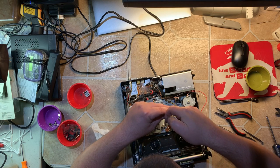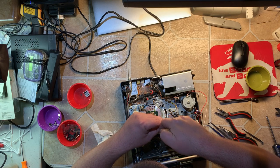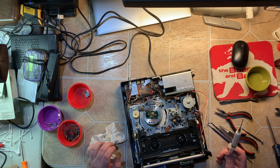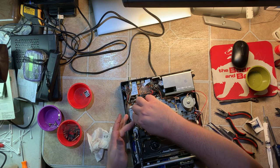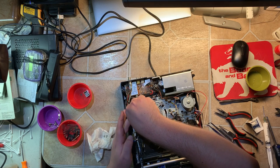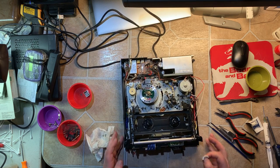Whenever it goes to operate, it'll smooth itself out. Try to pull back, relieve pressure. I lubricated the spindles, lubricated the impedance roller — it's been sitting a while so I'm wiping off any excess oil. Lubricated and cleaned the pinch roller. Okay, that should do it. I'm going to go get the test jig. Let's see what this thing does.